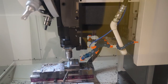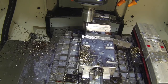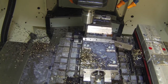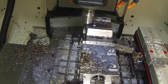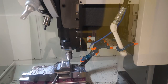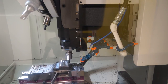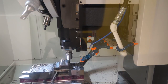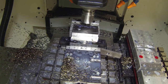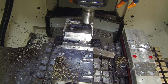In terms of the high-power version, there are options with the machine — you can go for the 10K with the high power. But can you go for a higher speed spindle? You can go for a 24,000 RPM high-speed spindle. But the compromise on power is you haven't got the torque that the 10,000 RPM machine has. With the small cutters doing small detail work on aluminium, cutting electrodes and 3D-type work, it's ideal.